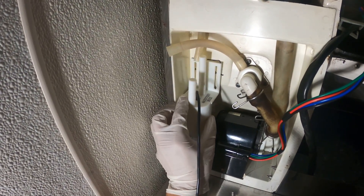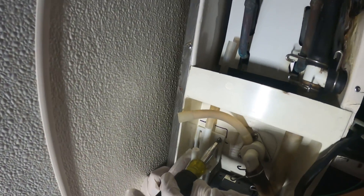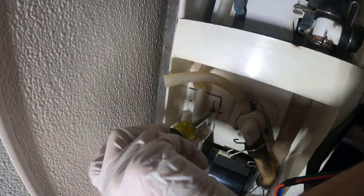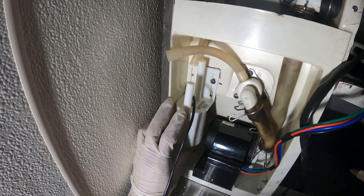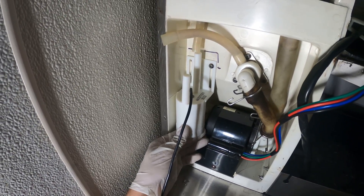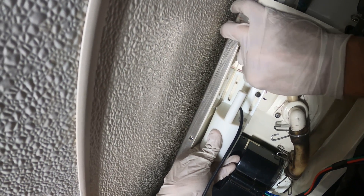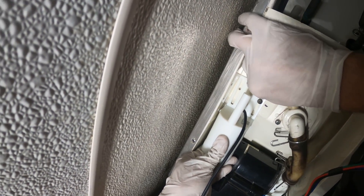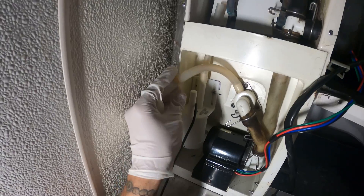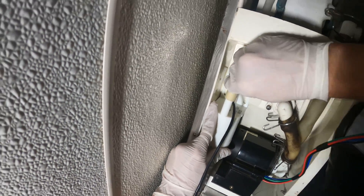Here's the new float. It's going to match up exactly where I drew the lines and put in the screw — I'll have to go get another screw later. It looks like the threads for this are also gone, which is why they put that tape to hold this thing up. Once this fills up with water, this thing is going to fall and you're going to damage the whole level sensor for the system and not make ice properly. If I attach this hose right here, it should actually hold it up — yeah, it is holding. I guess this will hold it as well. Let's plug this in; we need to get some good screws here.